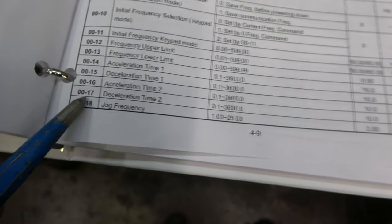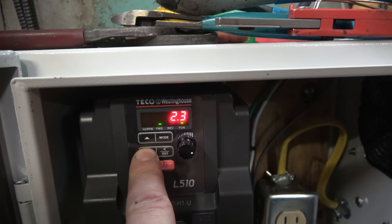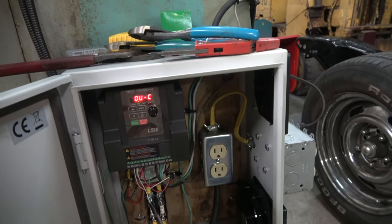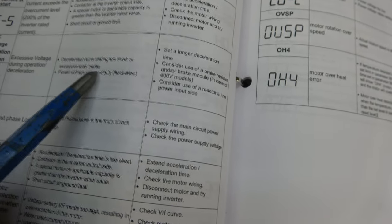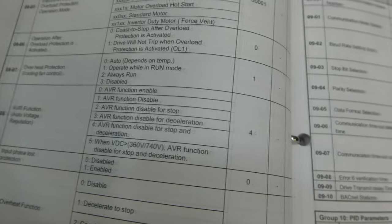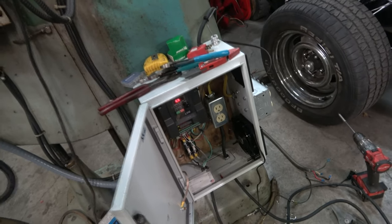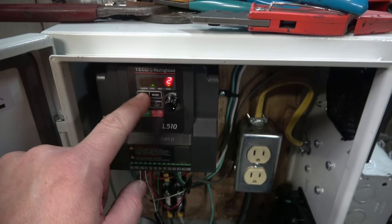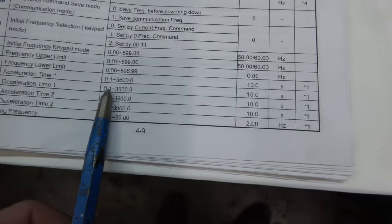E-stop. I've changed 0017 — decel time 2 to 0.1 seconds. I got my drill press set at 0.1 and it stops on a dime. This machine is not liking that though — it stopped faster, but I'm getting an overvoltage error: decel time set too short or excessive load inertia. There's more rotating mass in this than a drill press, maybe that's why. I'm going to play with it. The fastest decel time I could muster was 1.5 seconds. It's just a regular e-stop — you don't have to go in the box to reset it. Ready to run again. The fan runs while the motor is running.